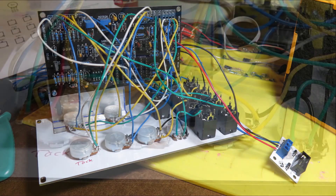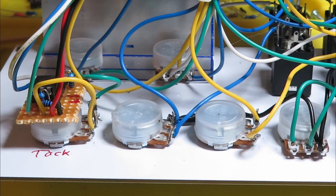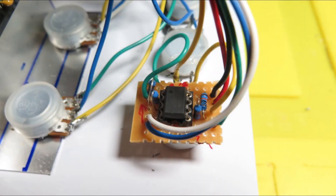The pulse width modification was installed, but surprisingly the pot limits were still being hit before shutdown. The mod was built using 100k and 24k resistors, giving a gain of 1.24 — enough on the breadboard but not here. Changing the 24k resistors to 33k fixed the issue: pulse width now reaches the shutdown point before the pot limits, giving a range from 0% up to about 98%. The mod was built on a small piece of stripboard and hot-glued to the pulse width pot.